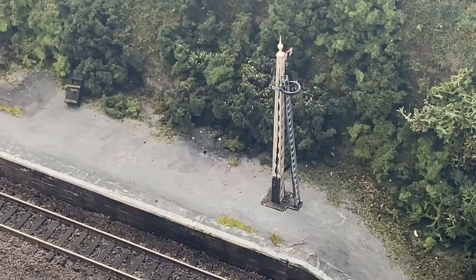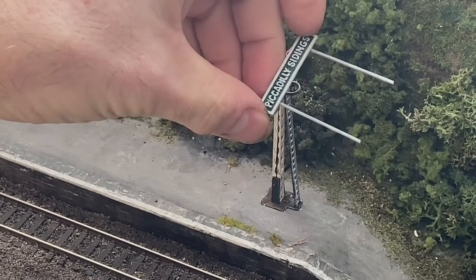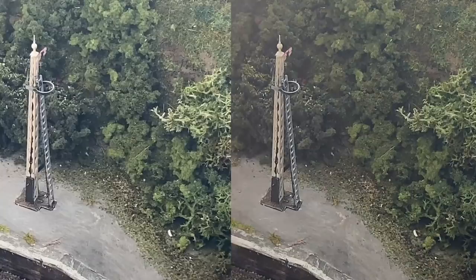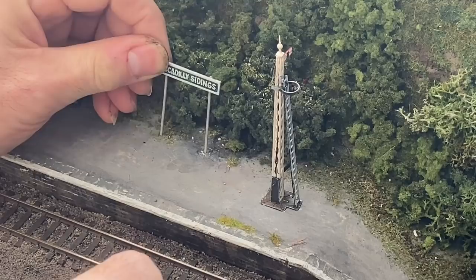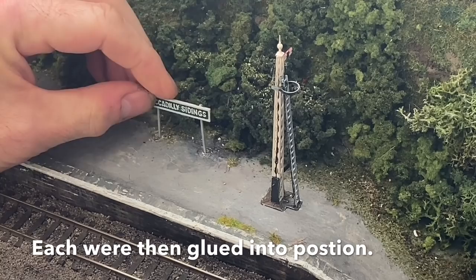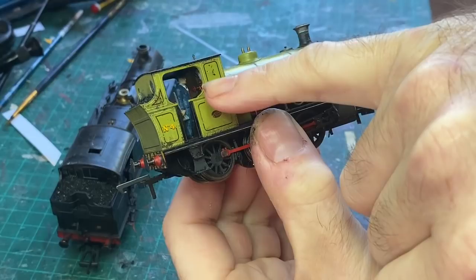And then I've got a 2mm drill bit. Now you might say to me, John, that's 1mm. That's a 1mm strand across the flats, the opposite flats, but across the diagonals, it's more than a mil. So I'm using 2mm to make sure I get it in exactly the right place. I'm now going to poke that one in ever so slightly, then I can mark off the other one, just like that, making sure that the holes are into the hole, just like so.